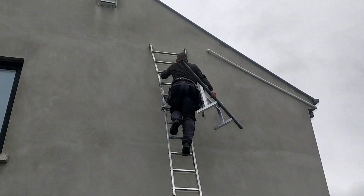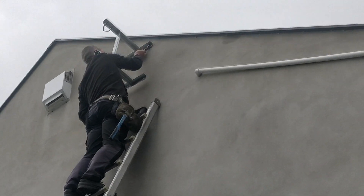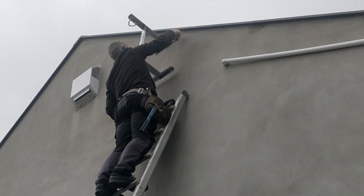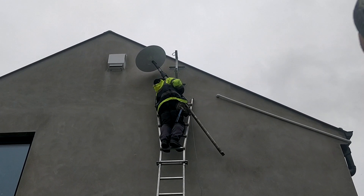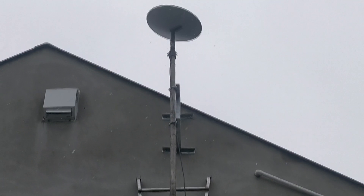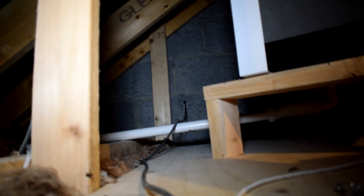As you can see, the H bracket goes on first — I'll link one in the description, but just make sure you get high enough quality gear for this type of install. It's not worth having something fall on something or someone, so please don't spare any expense — it really needs to be rock solid. Next, the Starlink dish, the adapter, and the bar are all screwed into that bracket. Then we bored through the wall into the attic. As you can see from the outside, on the left of our bracket there's a vent for our mechanical heat recovery system and on the right a small waste water pipe. While your wall may look blank from outside, please go in and check the inside too — we went in and out a couple of times to make sure we were in a safe location and wouldn't hit any wiring or machinery.